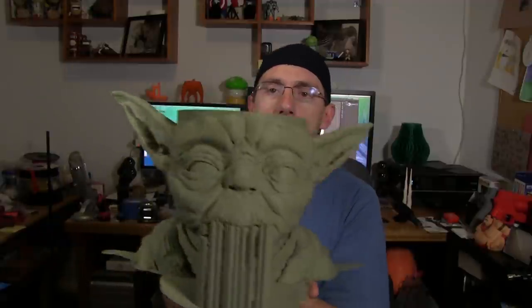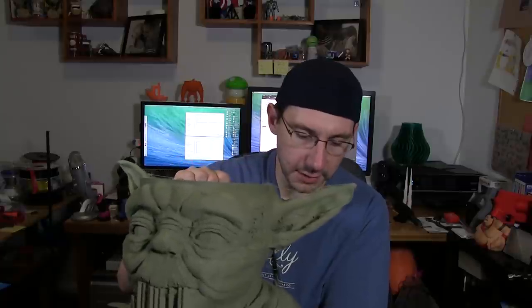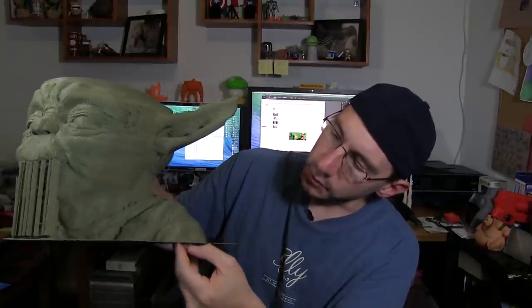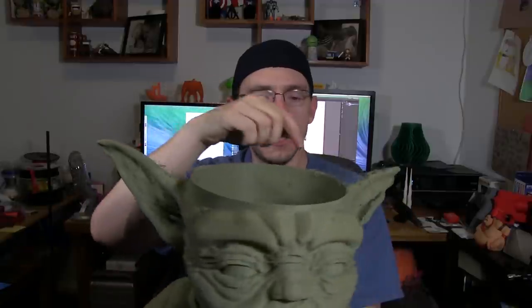When the model first comes off the printer, it looks just like this. In fact, this model here was pulled from the printer just a few hours ago. It's still got the stringy filament on the ear. It's got the raft and it's got the support structures for the chin and the upper lip — it's printed all as one piece. You can tell because the perimeters are the only thing holding the bottom layer to the rest of the model, so it's kind of delicate. When I'm trying to pull away this raft, it's starting to pull away just a little bit at the bottom, and what will most likely happen is the raft will just be cut to shape and act as another bottom layer. You can see inside the bowl it's got some stringy bits going in between.